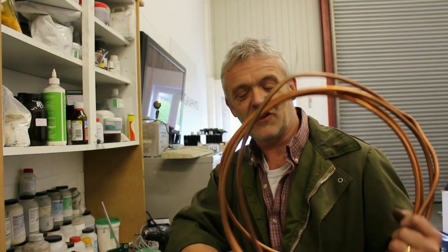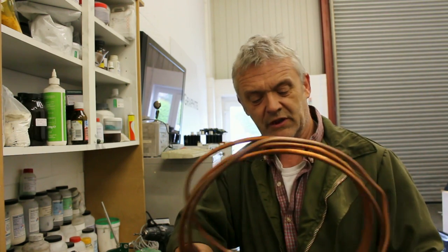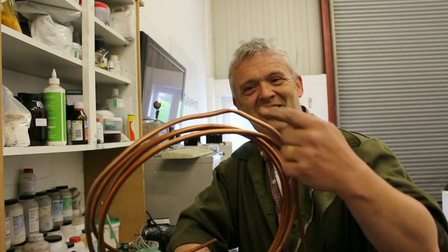So for various reasons, what I want to do is make an induction heater. One of the prime things when you make an induction heater is the coil, and coil bending itself is kind of problematic. For the induction heater, we need something pretty sturdy and pretty tough, and we're going to use this stuff. This is 8mm copper pipe, which is quite flexible in itself, but the problem is, if you start to bend it, you get kinks in it.